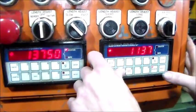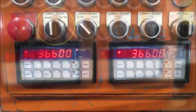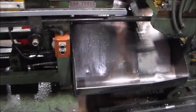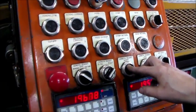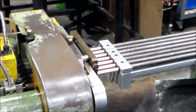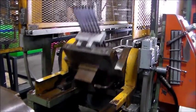You can also use the counter to preset the length of the tubes. To do this, press the Program button, then press Preset 1. Input the value for the length of the tube, press the Enter button, and the machine will adjust to the correct length for the hairpin. When you have set both sides of the machine to the proper length, remember to turn the length adjust switch back off. The height alignment of the straightener can be adjusted using the two buttons for raising or lowering it, found on the side of the machine next to the hairpin tube catch pan. You can make this alignment easier by reducing the length of the hairpin leg on the left switch tower side. This will extend the carriage of the cutoff so you are able to inch the tubes back and forth with the feed and feed backup buttons to see how they line up with the guides. With the shorter length set, it is easier to properly align the tubes to the guides, then reset the leg length to the proper number. Always push the bend return button before feeding the tubes to assure the bend head returns fully, as sometimes it relaxes up off the positive stops.